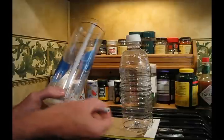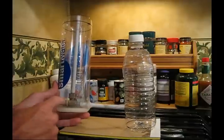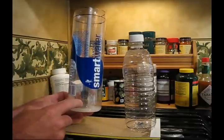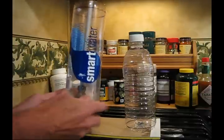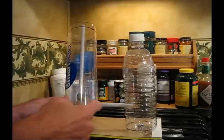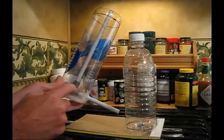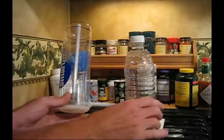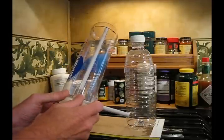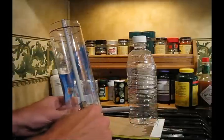What I did was I got this tubing — it's actually a fill line for a toilet. I also bought a quarter-inch tee fitting, and then I bought a compression cap for the outside. I was able to compress this vertical tube, but through installing this, I had to glue that inside. There was no way to get in there to compress the nut or tighten the nut. This is just simply marine goop, so I just coated that a bunch, threw that down in there, stuck that through, and then sealed the outside.